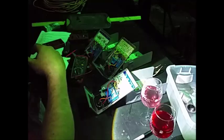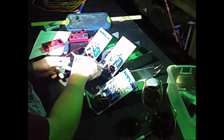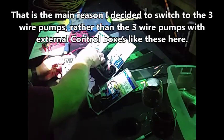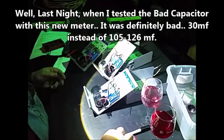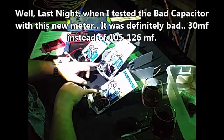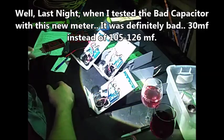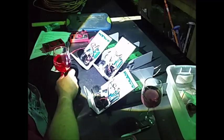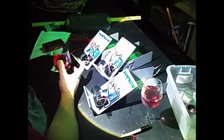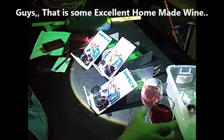That's the only one I hadn't worked on. Letting the pump cycle I don't think really kills it because it's been doing that for a long time. This is the very first time I've ever tested a capacitor — right now with this meter. So: 106, 106 BMIs, and the Dayton's 120. When I check the next Dayton if this works okay, I'll probably go ahead and buy another Dayton capacitor, and if it's 120 I'll just figure it out. The manufacturer picks a range and that's what it turns out to be. It's within specs.